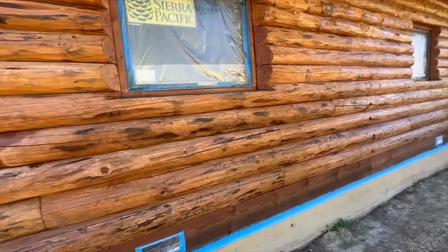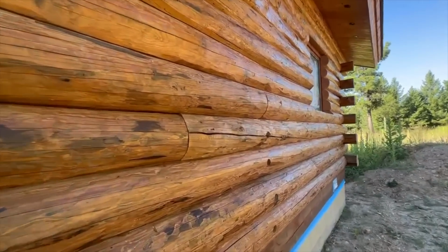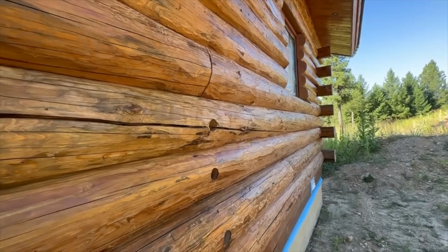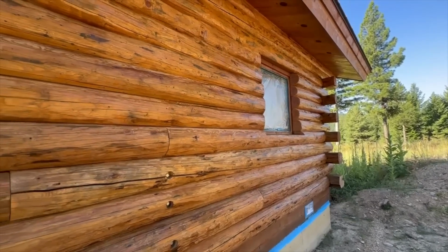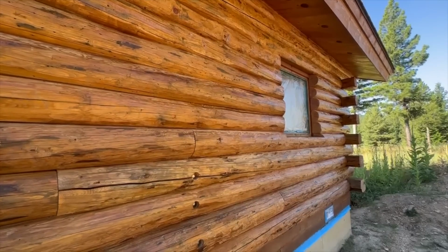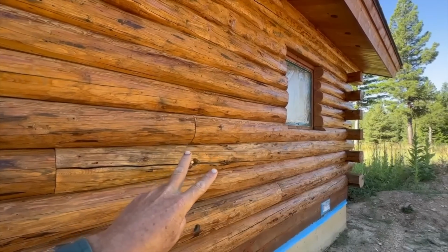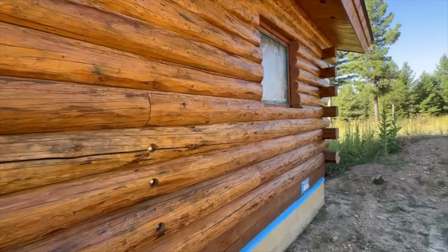This is one coat. So we obviously pressure washed it really heavily yesterday, and it brought some of the color back. It was 2 years old, which was actually my recommendation. So as you're looking at this finish now, the first coat, there's gonna be this first coat, and then the second coat of color, and the third coat is going to be clear top coat, which is gonna be milky, and then it'll turn clear.